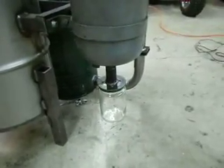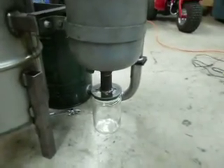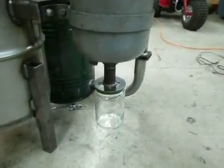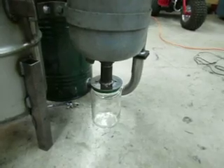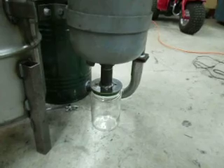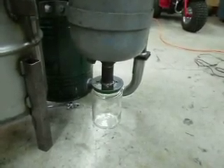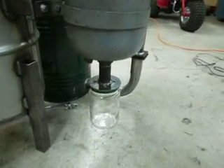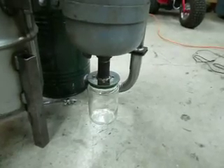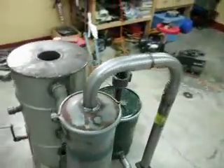At the bottom of the cyclone filter you can see I've got a 24-ounce sauerkraut jar with a one-inch pipe nipple sticking out. It's got a one-inch hole drilled in the top and four quarter-inch holes. Before I bolted everything up tight, I put a good bead of orange high-temp RTV silicone between the lid of the sauerkraut jar and the plate to seal the whole unit. It removes very easily to empty out ash and contaminants.